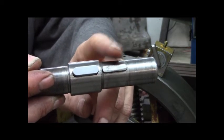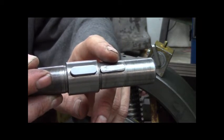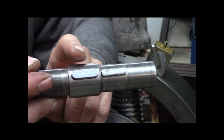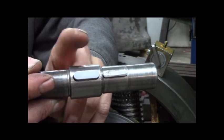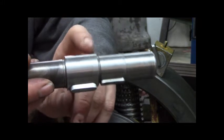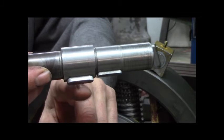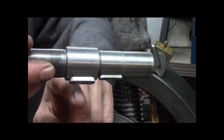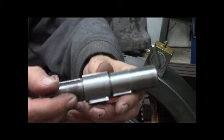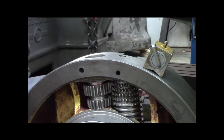The small key is a good tight fit - probably six millimeters - but it fits nice and tight into a gear that we're not using anyway, so that's fine. The big key is a very light push fit. To grab these keys out you grab them in your Kurt vise, which is really nice for grabbing and yanking them out if they're press fit. Talked enough about that.